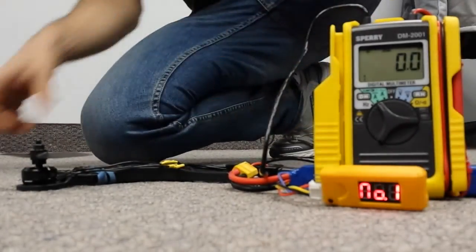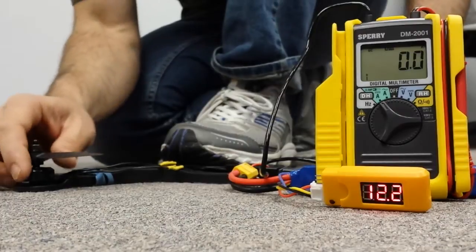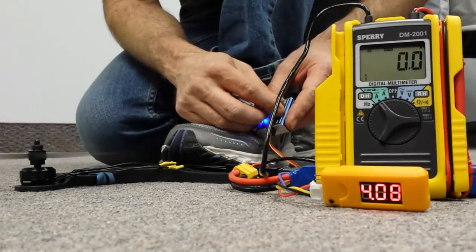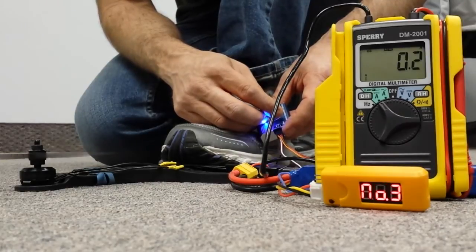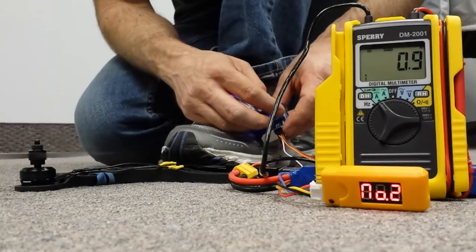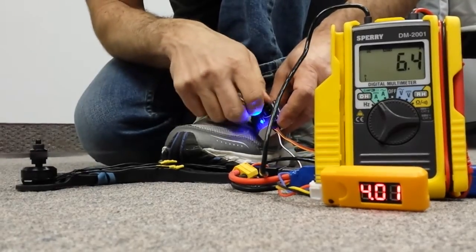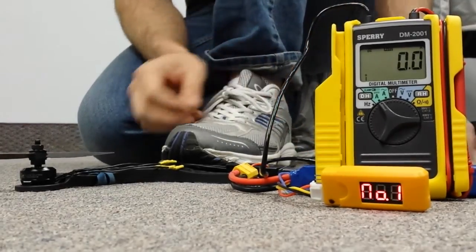The other thing I should mention is when I've been playing around with the different settings and timings, some of them actually sound really bad. I thought I'd maybe killed the bearings on this motor from all the testing because it was making a kind of grindy sound at low speed when it was set to high timing with mag on. But the nice thing about finding the right setting is that it seems to run smooth through most of the RPM range — that's the smoothest sound this motor gives. Sounds good to me.